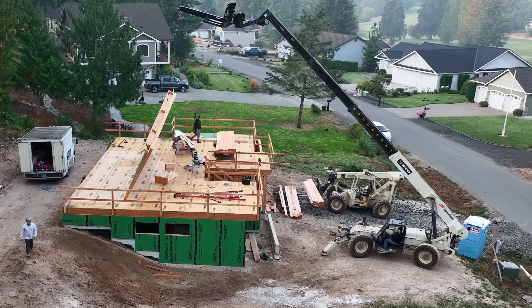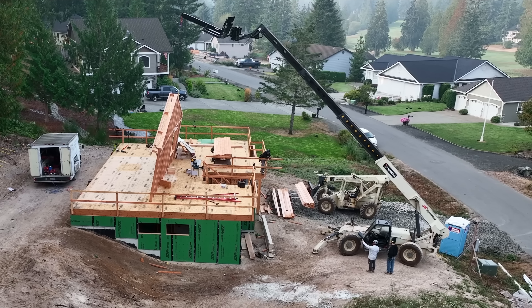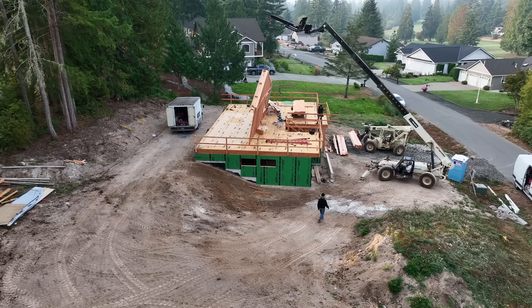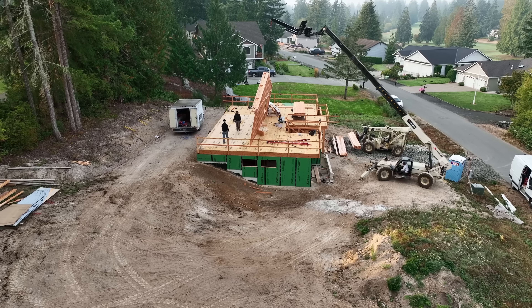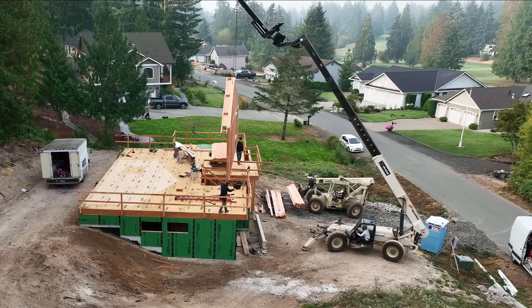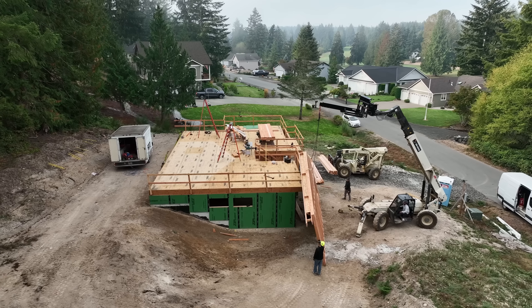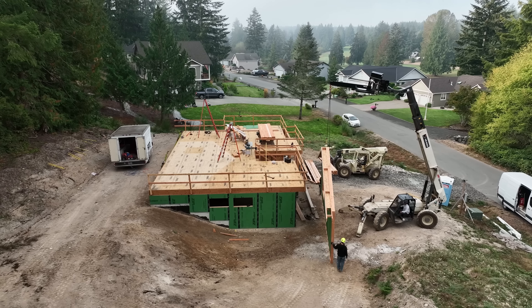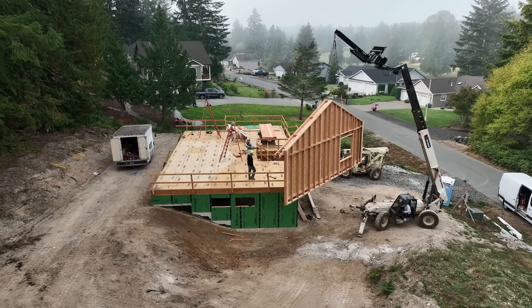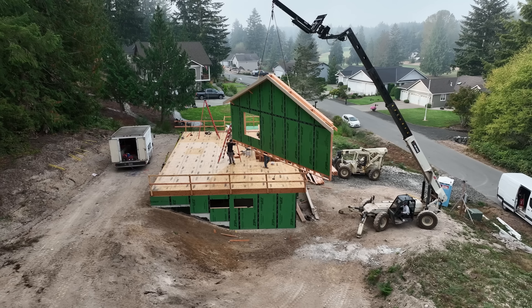This was an odd pick. I had Noah in the machine — he is forklift certified, I am also forklift certified, we just got recertified last spring. I am signaling as the experienced person. Kyle also has rigging experience from oil platforms or something. I got in the machine once the wall was up because we knew we were going to set it down and then shift. The ground where the forklift is at is very unlevel and there are some bumps there. Even though this took longer than I would have liked, because it happened safely, it was worth every minute. We had set it down, disconnected the rigging, then moved again so that all I needed to do was go up and out.